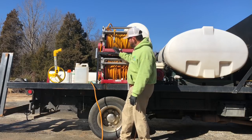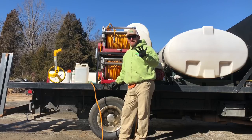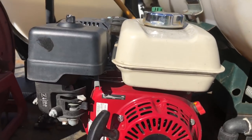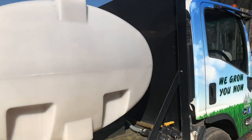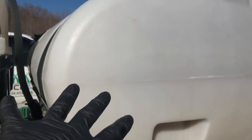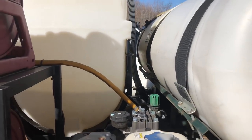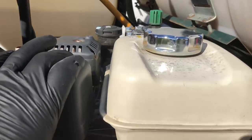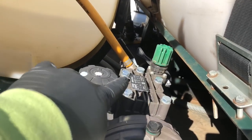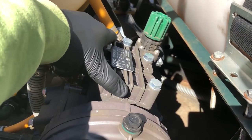You're going to need four things to accurately calibrate your sprayer. First, obviously, you need a sprayer. In this example we're using one of our spray trucks, which has a double three-eighths, 400-foot hose reels with a 500-gallon and 250-gallon setup so we can switch between different products throughout the day. My choice of spray system is the Kappa 43 gear reduction — it is a diaphragm pump. We have many of them and they work exceptionally well. You do have to replace the diaphragms from time to time, but it's not a big deal.